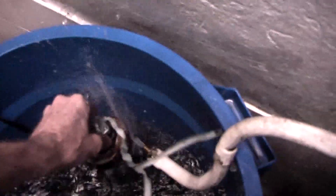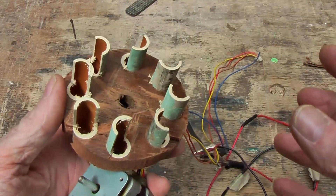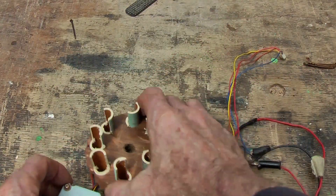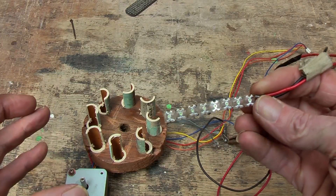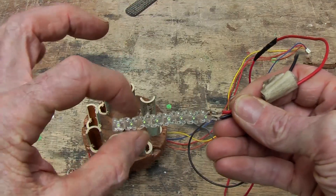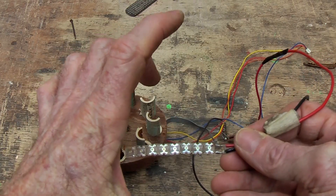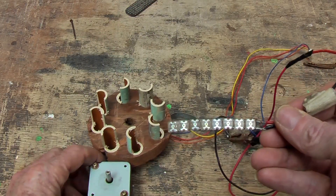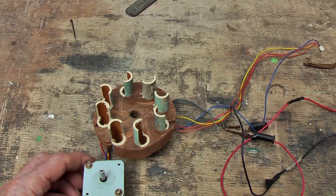This motor here spins fine and gives me 12.8 volts at that speed. These kinds of motors with this kind of turbine with that amount of water are going to give me 12 volts, which is fine - in fact it's too much voltage for these LEDs. They are three volts and will burn out with 12 volts fairly shortly. So instead of running them in parallel you can run them in series - four in series will give you 12 volts - and then run those in banks of parallels. Or I can feed that 12 volts into a 12 volt battery and run the system on 12 volts.